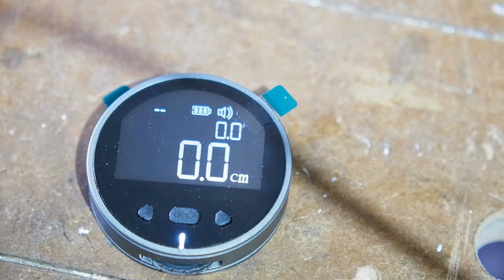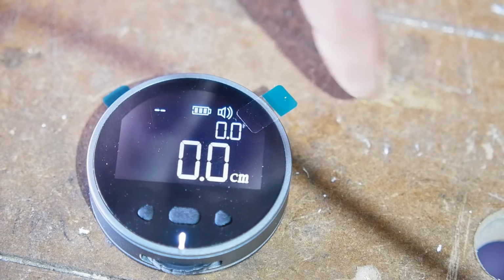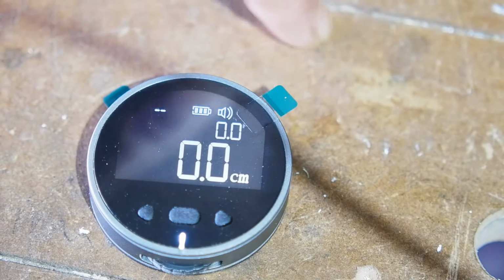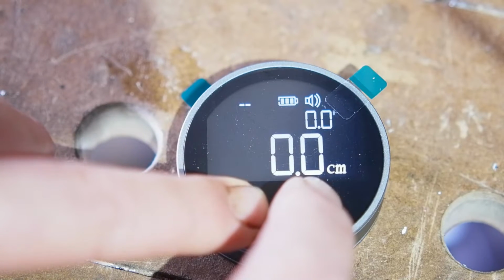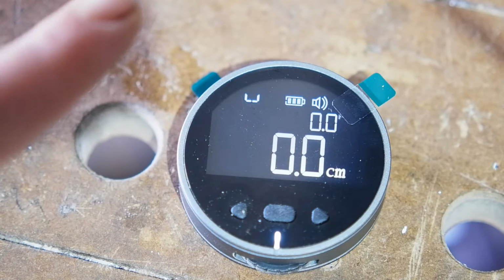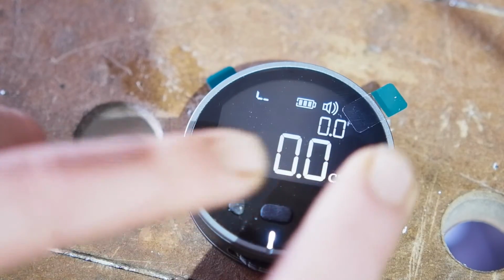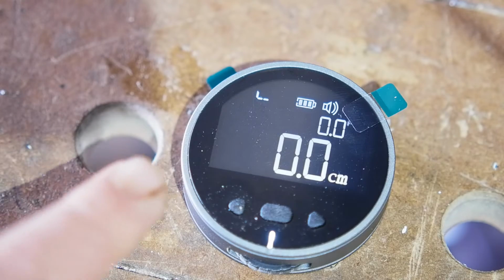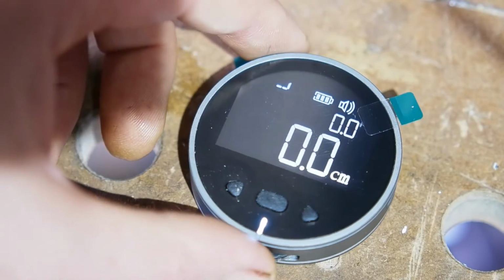At present, the 2 dashes in a line show it's an open-ended mode. Say to measure an island worktop in the kitchen edge to edge. Hold the left and right button together for the next mode, which by its U-shape indicates an enclosed mode, like inside a drawer, or to stay with the kitchen example, measure a worktop with a wall at either end. Next mode is enclosed left, open right, and the next mode the same but opposite.